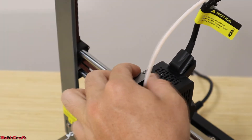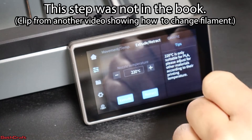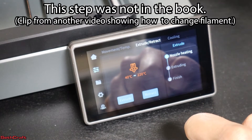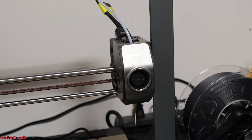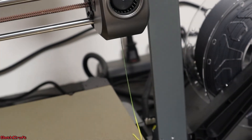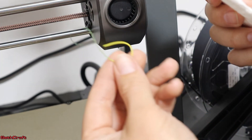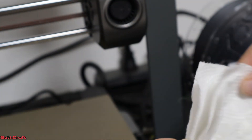Then I want to press the lock back into position. I'll go to settings, go to extrude, and extrude here — it's going to heat that up. I had some yellow filament in here previously, and that is being removed. The new PLA is now added. It's gotten rid of the previous color and is now set up and ready to start printing.